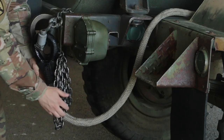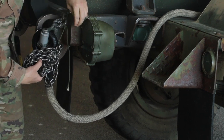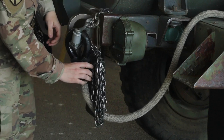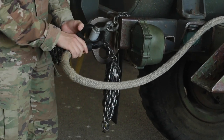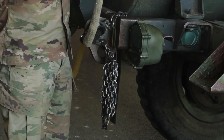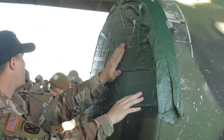You're going to move to your other sling leg. Make sure that your excess is secured to that grab hook assembly. Then you're going to check that grab hook assembly — make sure that aluminum roller is on the inside of that potted eye. And then you're going to check tape as well. Pick the sling leg up, make sure it's not misrouted anywhere, and then on this back just make sure there is tape.